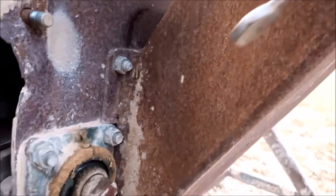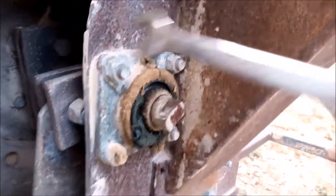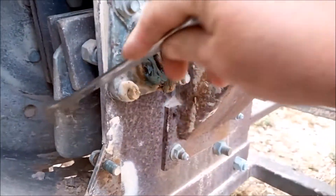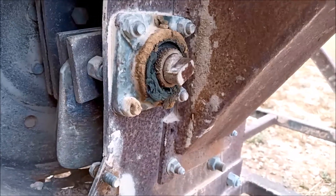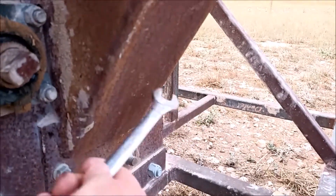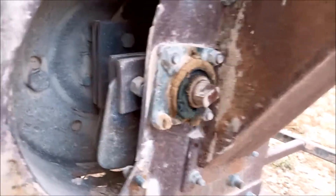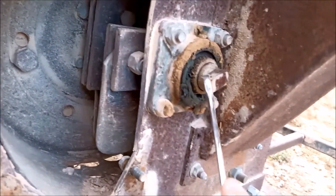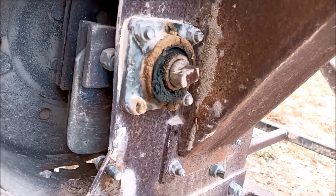The rocks just sit there bouncing on the blade and they can get ejected up sometimes. You sometimes have to get a hammer and tap them in, which is a pain. I've had times where they've jammed it up completely and the belt slips. That's what this little cutout is for — you can rock it backwards and forwards to clear the jam.